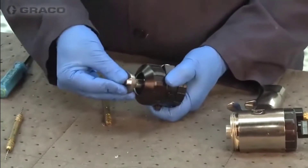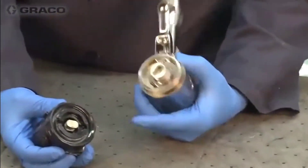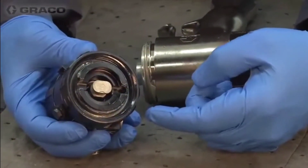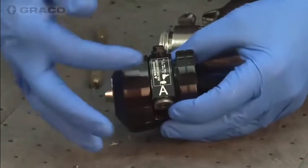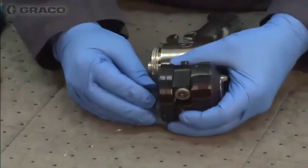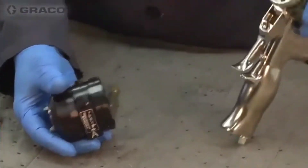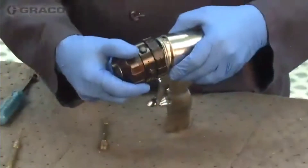What we can do is drill out that mix chamber — we didn't expose anything to air. Notice that the mix chamber is keyed with a machine half moon. That's to designate the A side of the mix chamber. We don't want to be mixing the A and the B. You can see that the head is clearly labeled A, or in this case A-not, which is what I call B. We don't want to mix the A and B materials. You can see that the piston and the mix chamber are keyed.